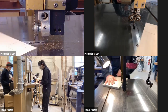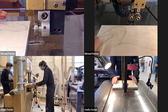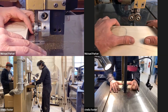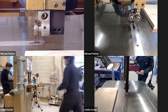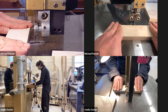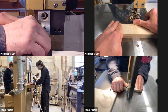On this side, say, or over on this side. If you're making a large cut, you can have your fingers through this way. I'm going to move my thumbs here so you can see them more properly. Let me find a little scrap piece of wood to demonstrate this. Say you're cutting a small piece of wood like this. You don't want to get into the habit of having your thumbs out to the side. You really want to have your thumbs tucked in so that you don't errantly get behind the blade and cut into it, okay?